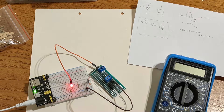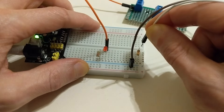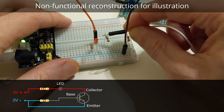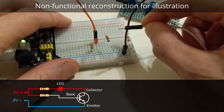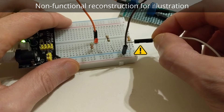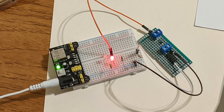The experiment was a success. To start with I was trying to switch the transistor off by unplugging the cable to its base, but that left it floating rather than pulled down to 0 volts. After adding a 2.2k resistor to ground, I was able to switch the transistor fully off by connecting its base to that, and fully on by connecting the base through the 3.3k resistor on the positive power line. At one point I accidentally touched the base wire to the wrong side of a resistor, so without resistance it got a much higher current, and since then the transistor always behaves as if fully on — I think I broke it.